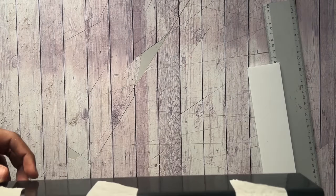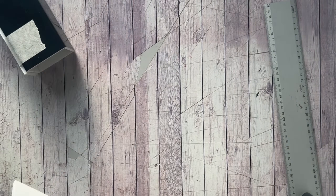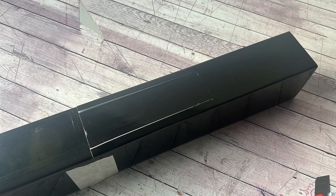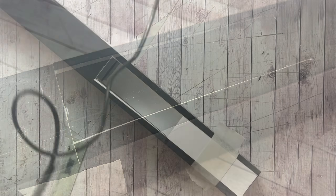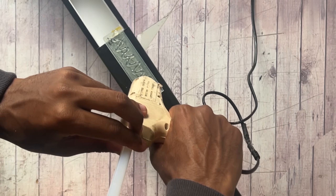Here's the technique of taking a foam board strip and taping it on the outside of the fuselage, which makes it possible to very easily glue the fuselage into its shape by gluing another strip on the inside. After finishing the two independent fuselage sections, we're going to join them together to form one whole 87.5cm length fuselage. Here you can see me eyeballing the fuselage after taping the two together, because you want to align them first before regretting it later. The front section is going to be the nose, with a hatch already made for the big LiPo batteries. After taping the two sections together, I'm using hard plastics to glue them internally on both sides, and then another plastic guard glued externally on the underside of the aircraft.